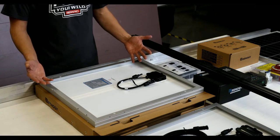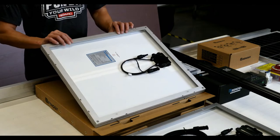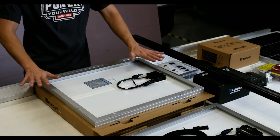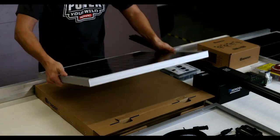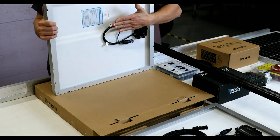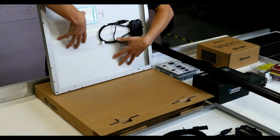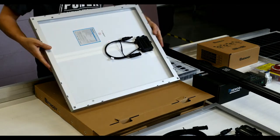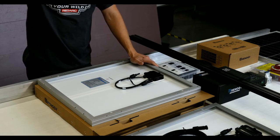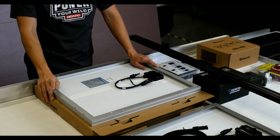I would stay away from flexible solar panels because the benefit you get with an aluminum-frame solar panel is convection. When this panel is up on the roof rack, even if it's really low, you have this chamber where air can move and cool the back of the panel. If you can imagine, you've washed your car, and on a hot day you put your hand on top of your car or truck, the sheet metal is so hot you can literally burn yourself on it. So